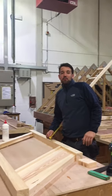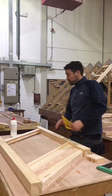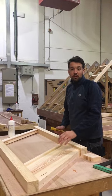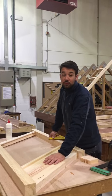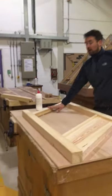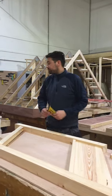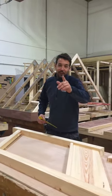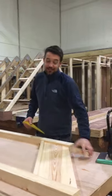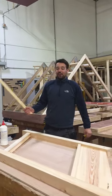Right, a little staircase project we've got here lads. So key terminology on the staircase: we've got the newel post, we've got the string which the treads and risers go into, we've got another newel here, this is our base rail, hand rail, and even experts make mistakes — these are spacers, and we've got the spindles over here.